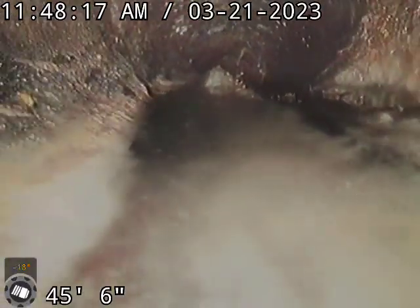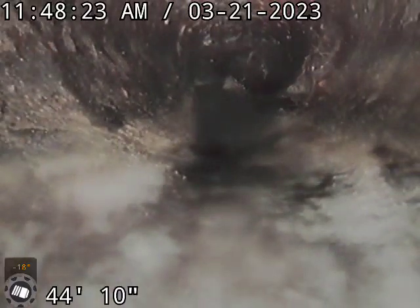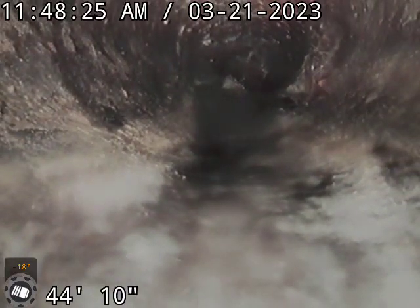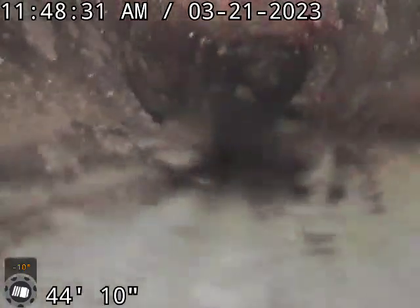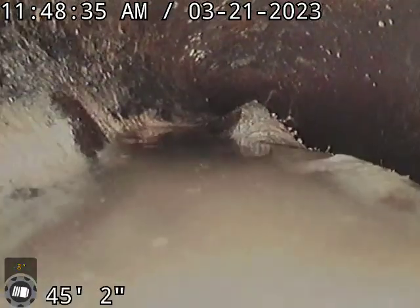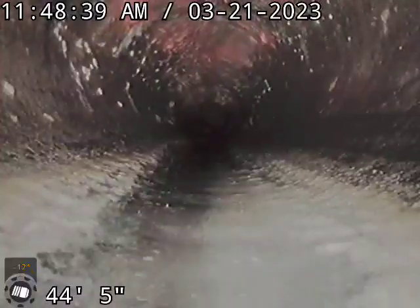It's been snaked out recently. We have these big bulges on the bottom, which are normal with Orangeburg pipe, where the pipe is actually washing away because it's been saturated with water. It expands and then it washes away. That's what we have right in this area here and in a few other spots.